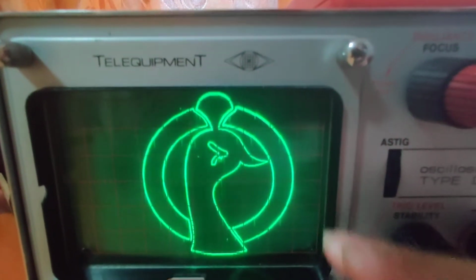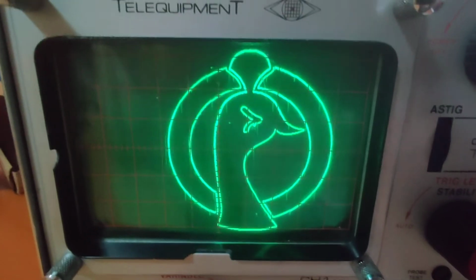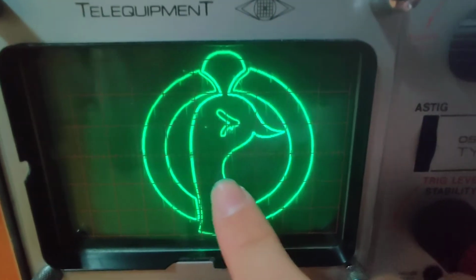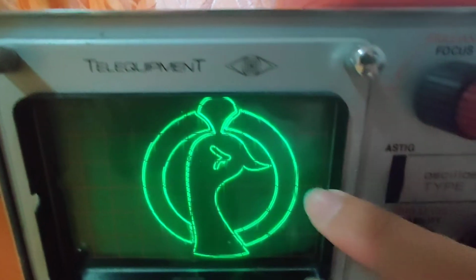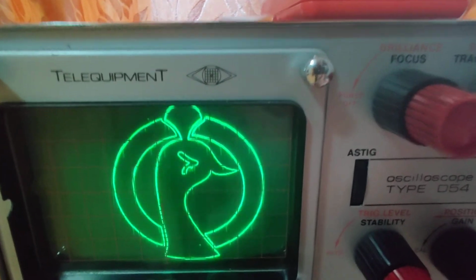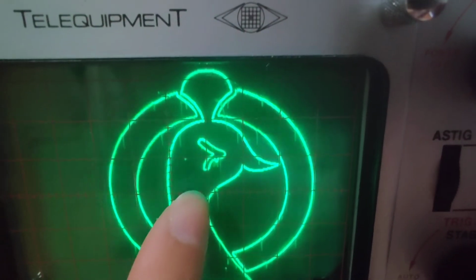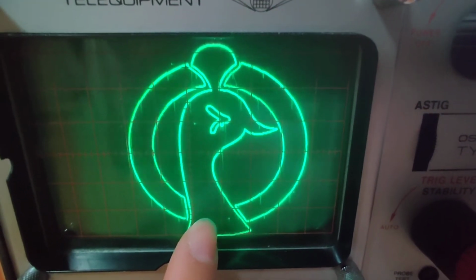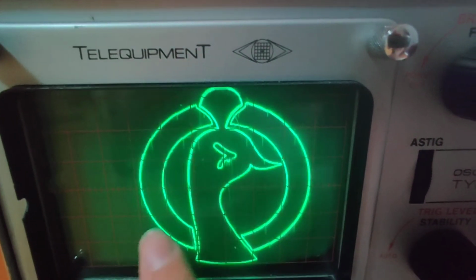Basically what happens is that, and you might be familiar with this issue from the reasoning why gray codes exist. What happens is that when we go, for example, from the lower half to the upper half, as we can see over here, this spike here, it's sort of midway vertically, the bits of the output don't change instantly, right? They sort of change in a ripple pattern or however, and that means in this case the most significant bit changes first, right? And it sort of makes the output jump down, and then when the other bits change as well, it jumps back up where it needs to be, right? But we can see halfway and at the quarters we have these sort of glitches.